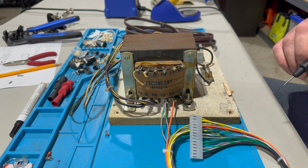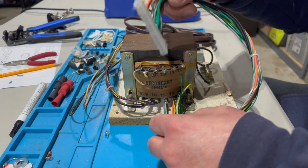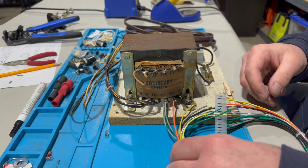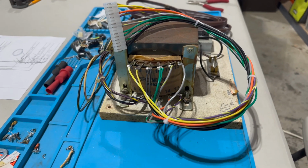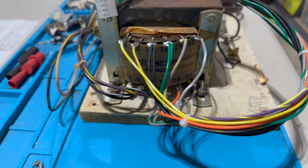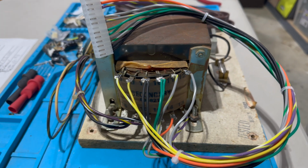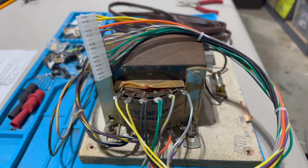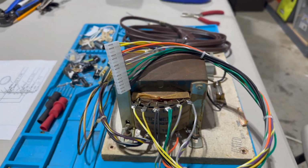Alrighty. So I'm going to go and do the rest of these on my own. No need to subject you to that sort of struggling. And then when we're done, we'll have our connector ready to go. So let me go ahead and do that. All right, that went on pretty well and pretty uneventfully. Once I got the hang of wrapping the wire around, it went on just fine. And I double and triple checked that I got the right wires on the right transformer lugs, and I tested everything with the multimeter on continuity beep just to make sure all our connections are good. So I think we are good to go here.